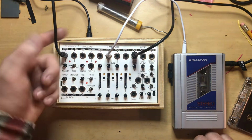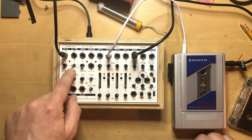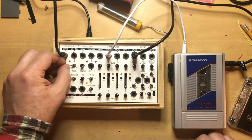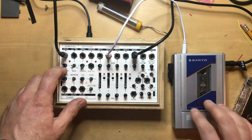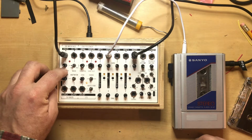I'm not using any control or trigger on the DC right now. I just have it in pulse width modulation, and I started at 0. That is also really important when you're starting this out, until you've figured out what this can take as far as voltage goes. The intensity knob I've measured.